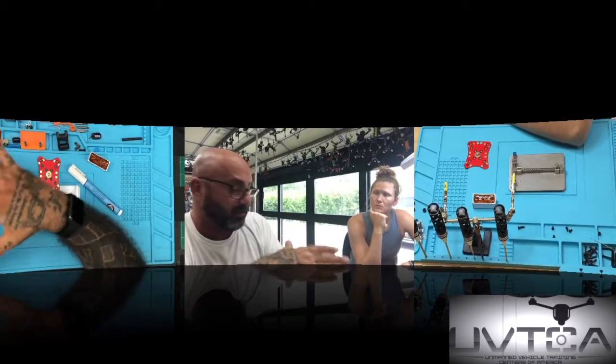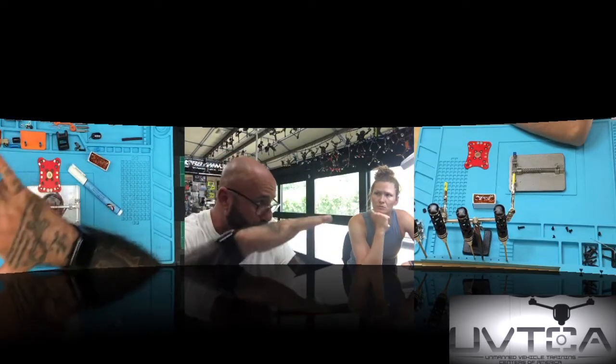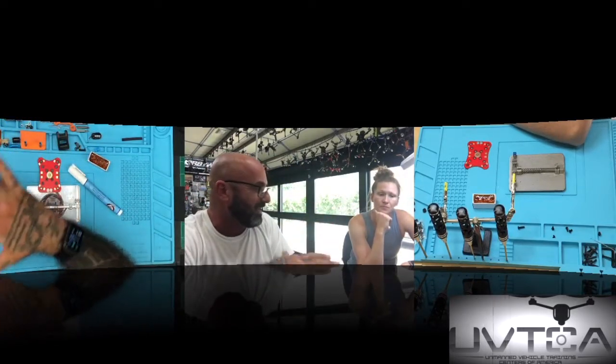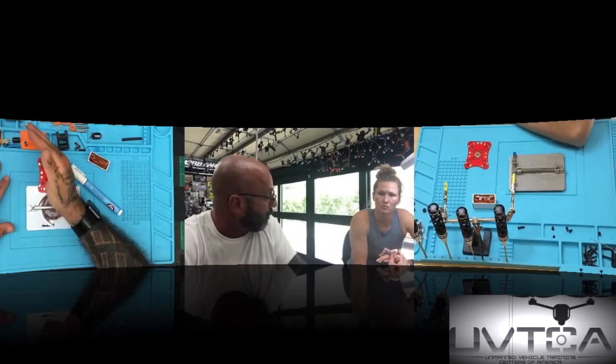And what you'll end up getting is a semi-melted area. And so the wire will not actually sink all the way down to the pad. It'll float on the top there a little bit. And so that's not how we want it. We want the wires to touch the pad and the solder to make a small dome over it.